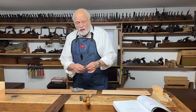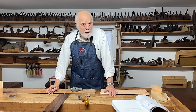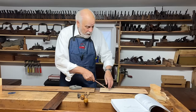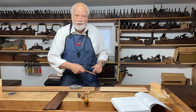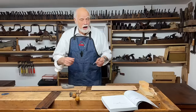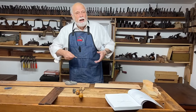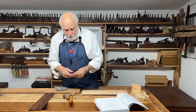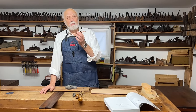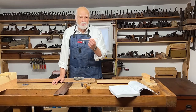At the least, you need a pencil. I don't particularly like pencils because they're made of lead and I don't want the lead marking the wood — it's sometimes hard to get rid of. I also don't want the lead getting in the way of my really sharp blades. But sometimes it helps, especially if you're going to be removing the mark completely. You can get a B type of pencil, which gives you a nice fat mark, but it's probably too fat and hard to get rid of.